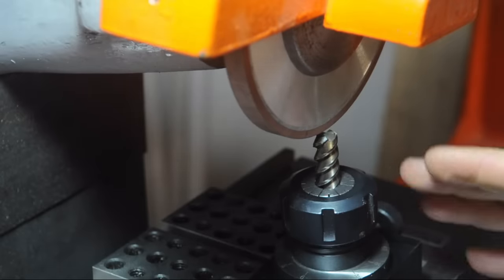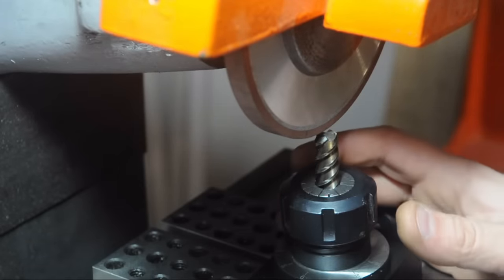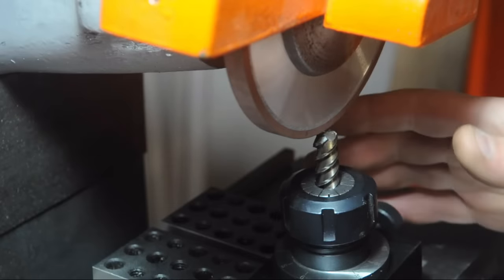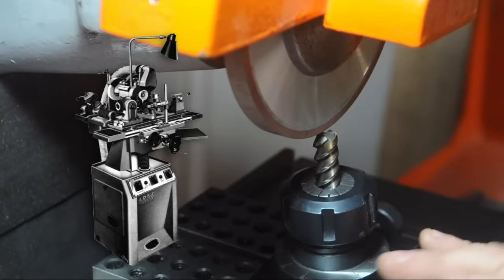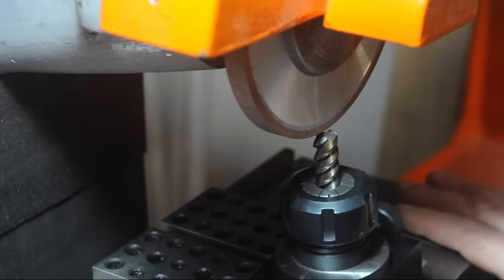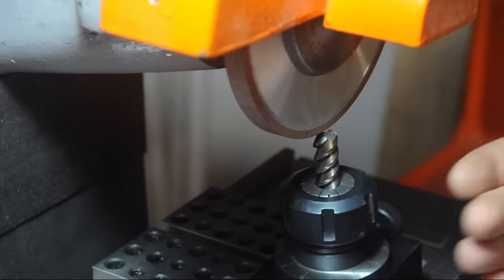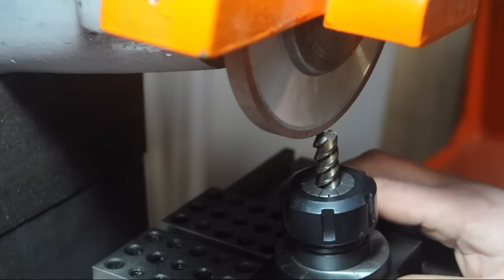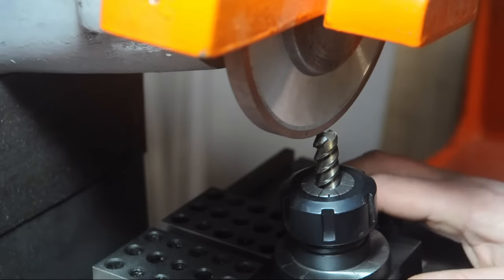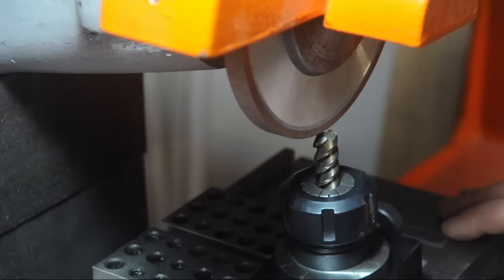First of all, this isn't the way end mills and cutters, etc., are really supposed to be ground. This should be done on a proper tool and cutter grinder. This fixture is more just a hack to add a little bit more functionality to a surface grinder. I think it's meant only to give a light touch up and bring an edge back to maybe not even a full-on dull end mill, but a dulling end mill. I don't think it's meant for this aggressive of a reshaping.